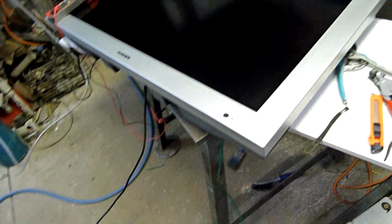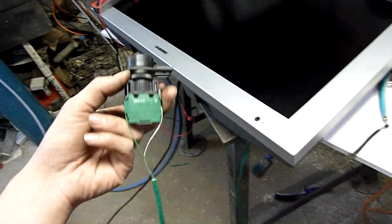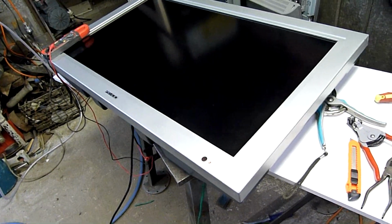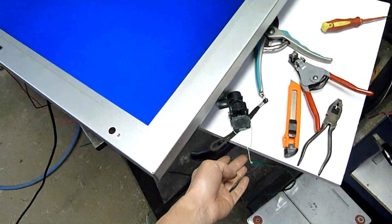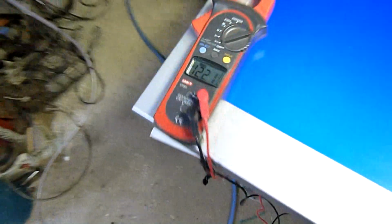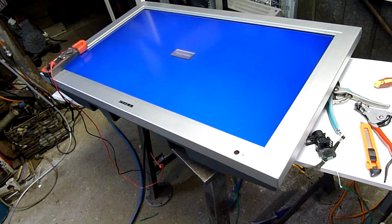Yeah, it's good. I could even have this plugged into one of the PLCs. As soon as the cut-off line machines come on, the PLC could send a signal through a bit of Cat5 and then go, ding, television on. Yeah, there's plenty of ways to work with this. It doesn't have to be shielded or anything. That's not even shielded, that's just regular Cat5e with no shielding. 12 volts still fine. I'll put some load on that and see what happens. Apart from that, should be good and work quite well.